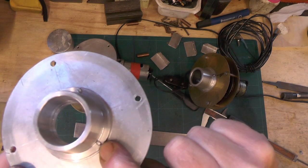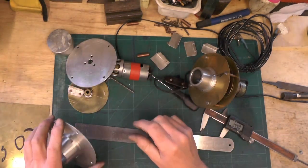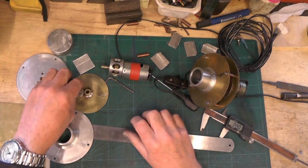I've attached that chimney adapter to the backing plate using three 6BA screws on a PCD of 1 and 7/8 inches. You just need to get your measurements to bring your screws into the centre of the flange you've made on your adapter — countersunk head.